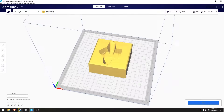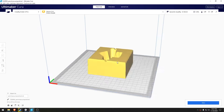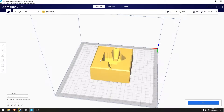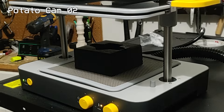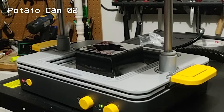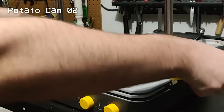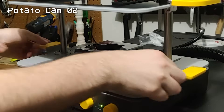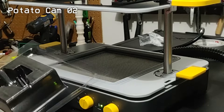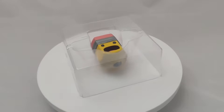For the next step, I needed to create the insert that holds the pencil properly inside the box. I made a basic cube in Blender sized to the dimensions of the final box, and used the pencil to carve out a negative from it. With the template ready, I used a vacuum former — this melts a thin sheet of plastic which then gets sucked around the template. After trimming the excess plastic, it's ready for the outer box.